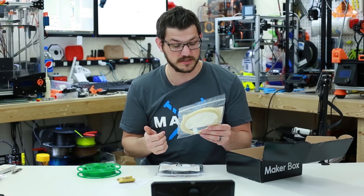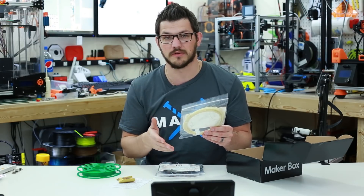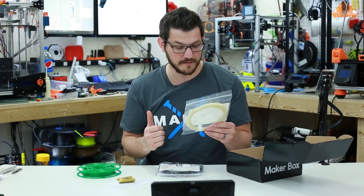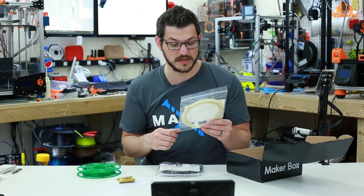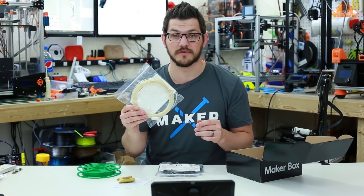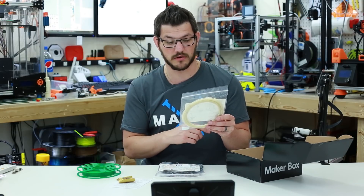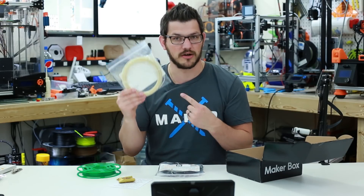The bed temperature is 100 to 110°C, speed is 30 to 40 millimeters per second, so it's going to take a long time to print. You're going to kill the PTFE lining in your throat if you have a printer like that, so pick up a Micro Swiss or an E3D all-metal hot end. The info says it's a blend of polyamide nylon and ABS for strong functional prints, and the manufacturer advises baking 24 hours at 40°C for best quality. Thankfully I have the FT5 and the CR-10S — both have all-metal hot ends. Since it's an ABS composite, you're also going to need your printer enclosed.